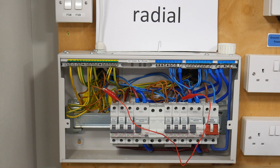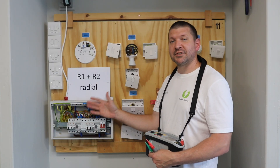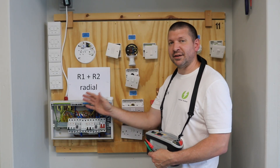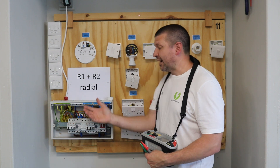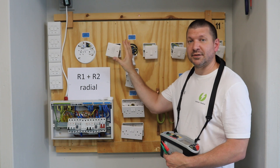So let's go back to the switches, my lighting circuit, and we'll have a closer look at where we need to test within the lighting circuit itself. We've just completed our temporary link between the live and the earth at our DB. Now we can come away from the DB and go to our circuit, because that's where all of our testing is going to be done.